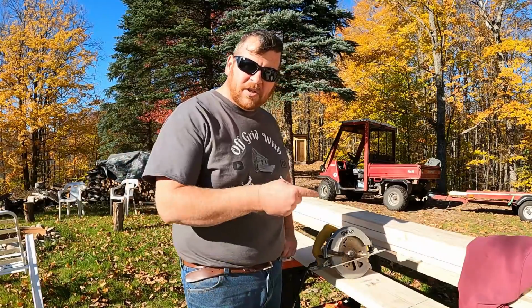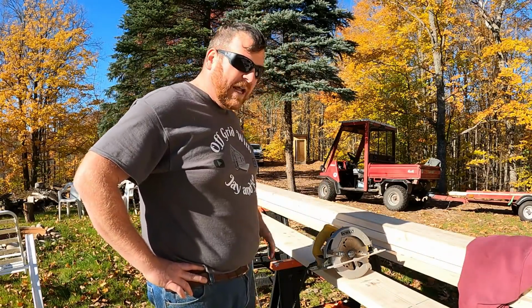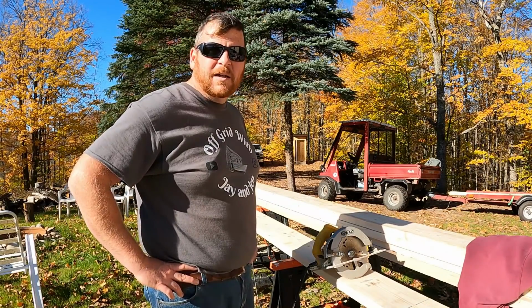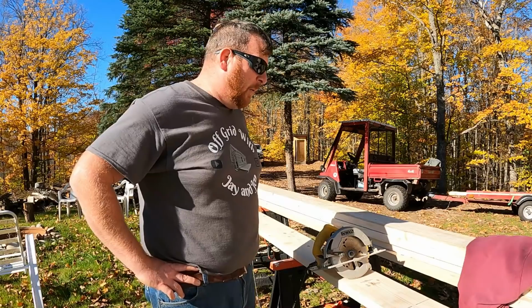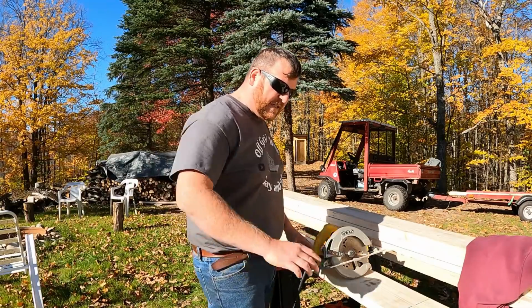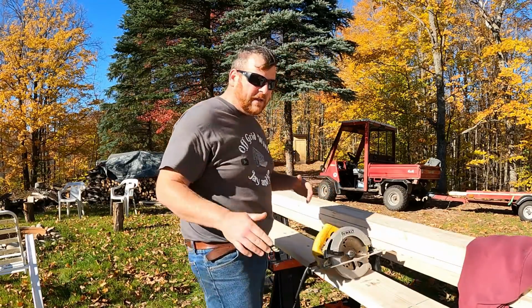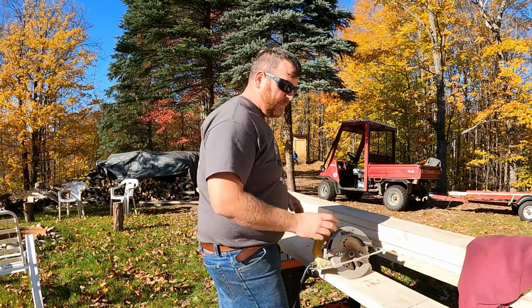So we got a bunch of 12-foot 2x8s, and we're gonna just make it out of dimensional lumber. I went back and forth 100 times trying to make it out of logs and this and that, but I want this to be somewhat strong and not questionable. I'm gonna cut 16 inches off of these 12-footers. It's gonna be just 16 inches wide, and we're gonna take it inside and get our angles. Try that the best we can.